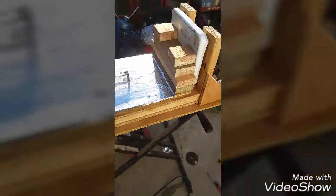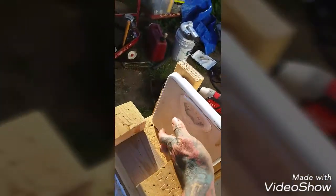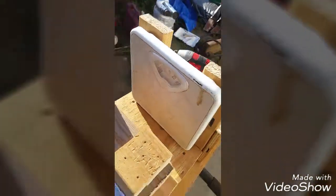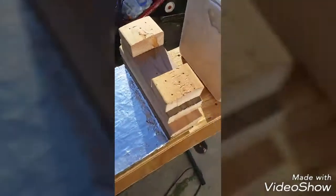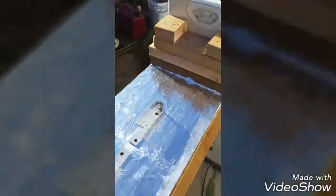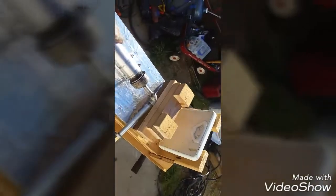Now get yourself some wood and make a platform. I glued a scale on the back of a two-by-four structure with 45-degree angle braces. When I push pressure on it, you can see this thing slides — that's how the thrust measurement works on the scale.